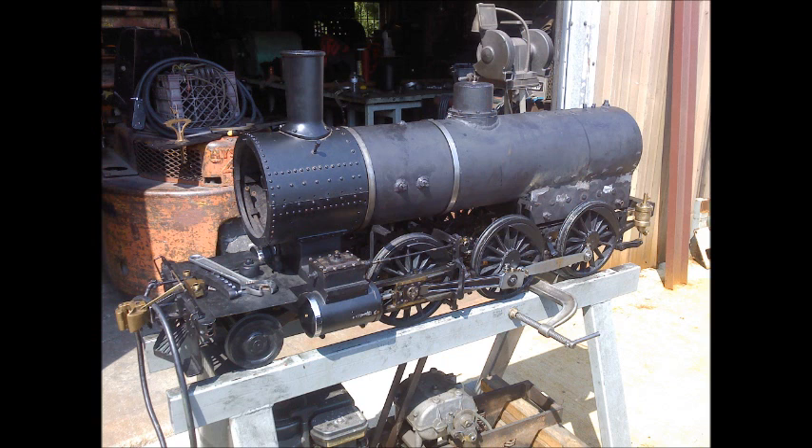The progress has been coming, and a little more work was done on the boiler. Since the last update showing the boiler being hydro tested, we put the throttle in the boiler, which was a little easier than I thought considering how small the space is in the steam dome. It's an Allen style throttle, which means it hangs from the top of the steam dome. When you pull back the throttle, a little slide moves forward towards the smoke box, slowly exposing the opening for steam to rush into and then go to the cylinders.